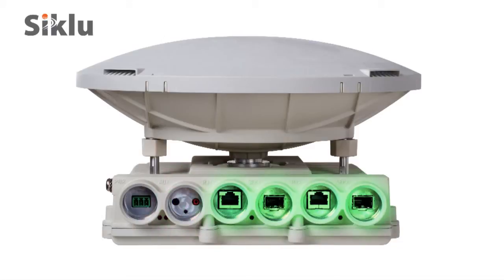Two or four active Ethernet interfaces are available depending on the hardware configuration of the ODU. These may be either electrical RJ45 or optical SFPs. Power over Ethernet connection is supported via the RJ1 port only. Ensure any Power over Ethernet device used complies with IEEE 802.3 AT.